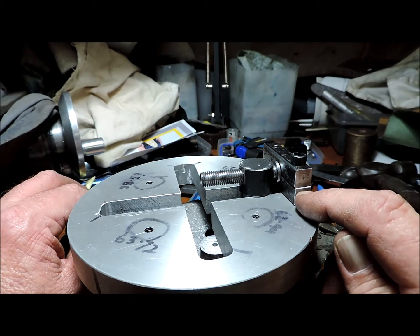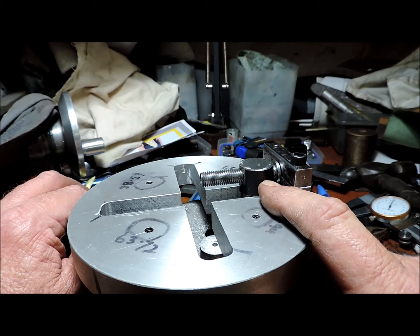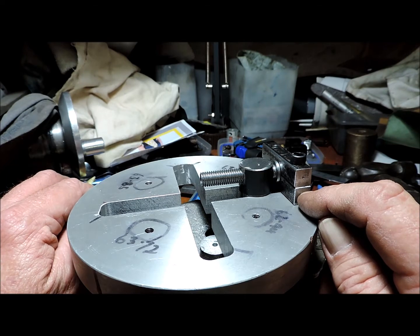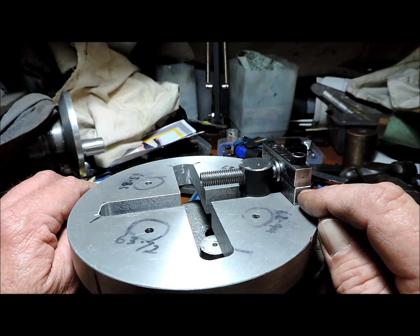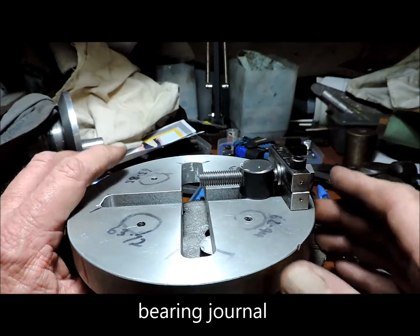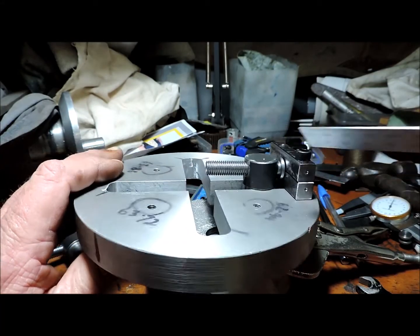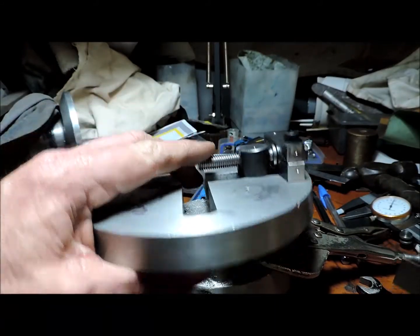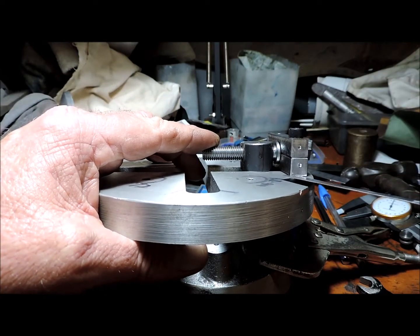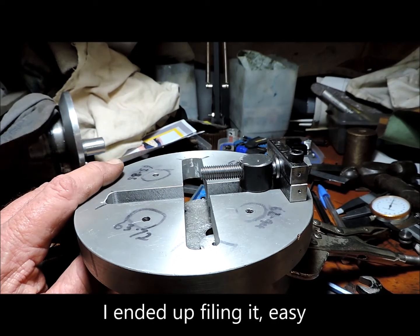I took off about half a millimetre too much off the nut, so I'll have to take a quarter to half a millimetre off the bottom of the lower bushing journal, because it's not sitting square on there — it's raised up just on the back. It will go up but it won't sit level, so I'm a little bit too high with the bushing. I'll let the machine — the mill — machine the bottom of the bushing off to compensate for that.